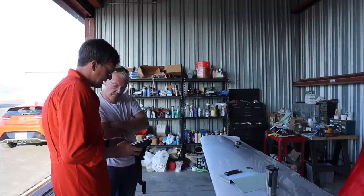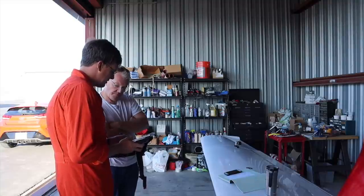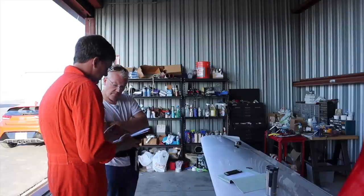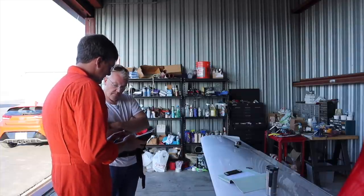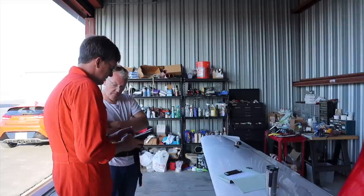We planned to do a gear extension and simulated go-around. I don't know that the simulated go-around has value, but I think doing an actual handling check down to minimum speeds has value. So we'll extend the gear at the gear speed of 100 knots. Gear speed's 122, right? Gear, yeah, 134.